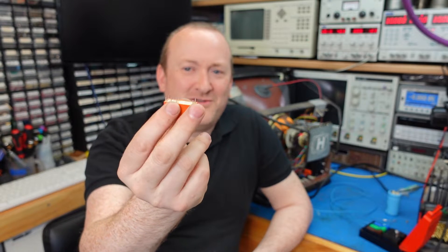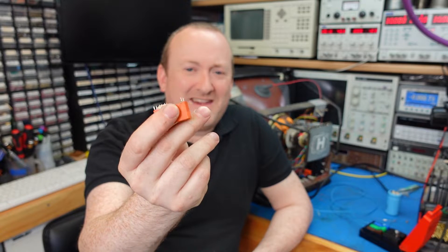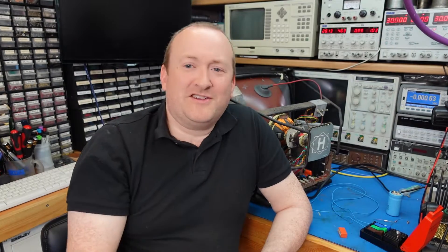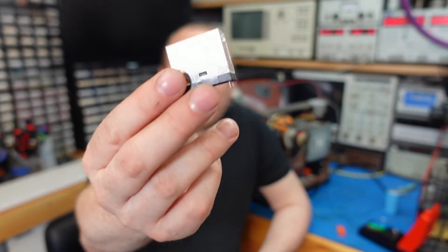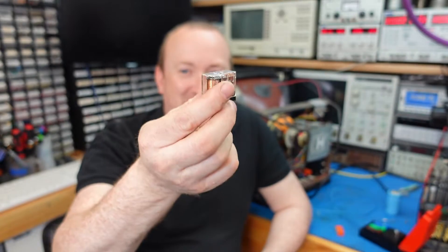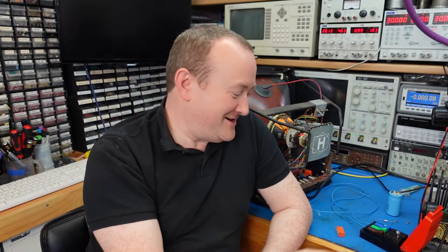There's also a good chance for water to collect underneath, trapped between the board and the component — so it can be a bit of a pain. It's a choice you make depending on what voltage you're switching. Other relays, like these, will clearly let water in. To be honest, a lot of repairs require these to be replaced anyway, so you may as well take them off before you clean the board.